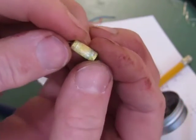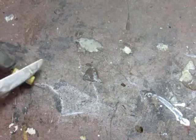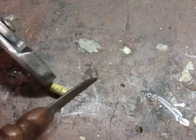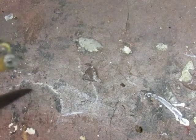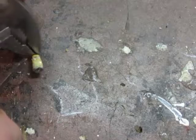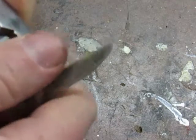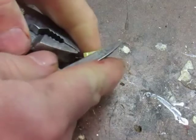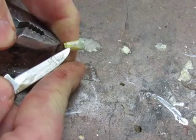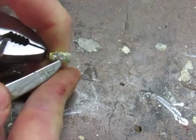If you ever wonder what was inside one of these little things, let's go find out. Oh, that just popped right open. Oh, that's what's in there. This is part of that LC filtering circuit. The L stands for inductor, and the C stands for capacitor. So this is the capacitor. It's a little metal film capacitor, which as I open it here, I'm gonna pry off the outside paper.